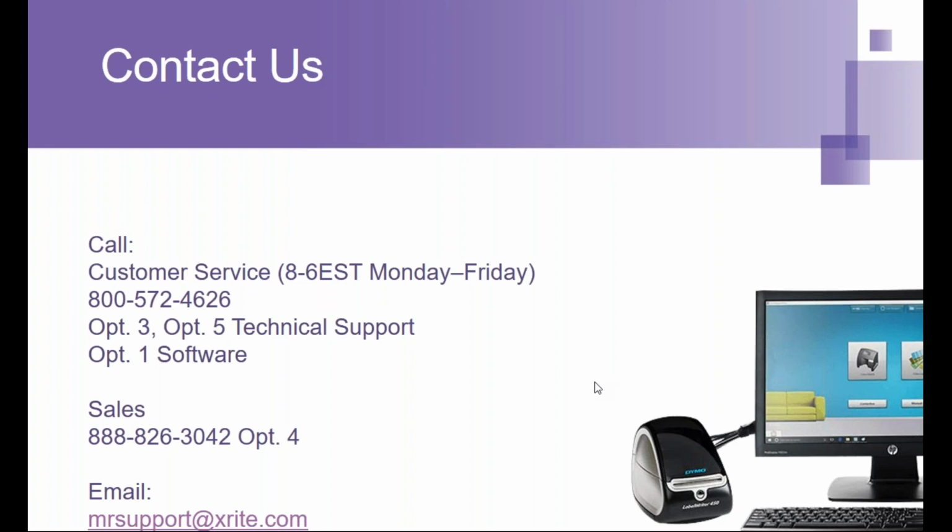The other one, it looks like we had somebody from an industrial company sneak in. One of the questions, and I'll let Tim answer this one: what about measuring something like ketchup or powder? Best answer I'd use for that is we can do it. Obviously, you want to control it. I would not just squirt ketchup out on your countertop and set the instrument on it. But you can use something like a cap. We do have some rigs and jigs for stuff like that, but the best thing is keeping it uniform and flat. Imagine if you had a powder, you put it into a melt cap, nice and flat, and center it over it.